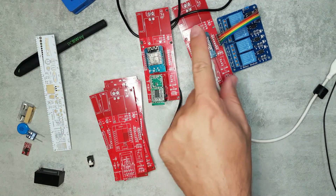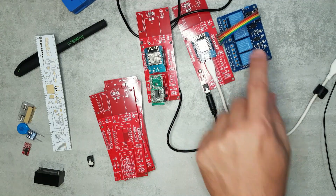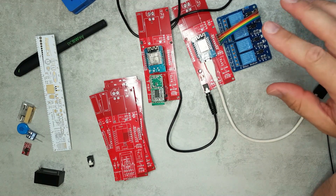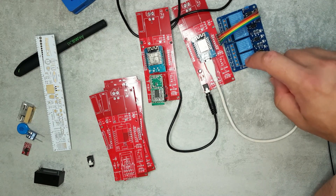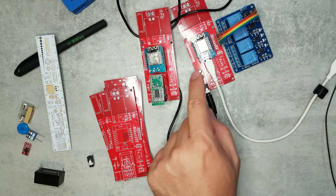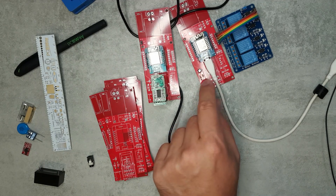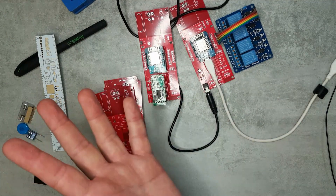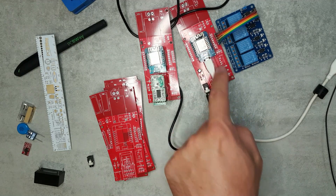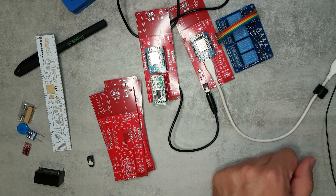For the fan board I'm using a relay board so I can control the fan. It has an on/off terminal and two or three speed-selection terminals, so I'll need more than two relays. I picked a four-relay board and I probably won't use the fourth relay. There are also two 10k resistors and a 10 microfarad capacitor, and I might add another temperature sensor. Note that the relay outputs use one of the I2C output pins, so you can't use the relay and I2C simultaneously — that's probably the only limitation.